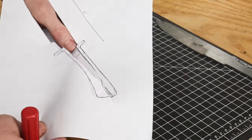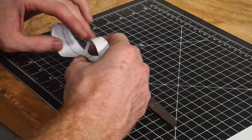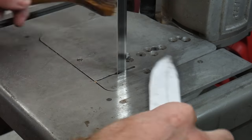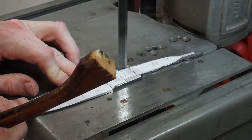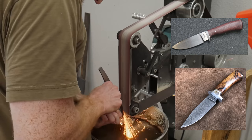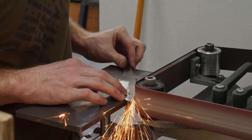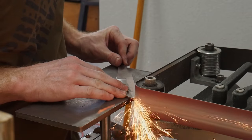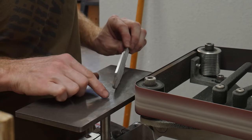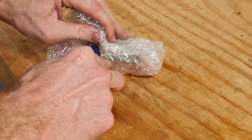I traced out the blade on paper, drew in what I envisioned with the material I had, cut out the template, and glued it onto the knife to easily grind the profile to its final dimensions. It's really interesting how different hidden tang and full tang knife design are — I find it significantly more difficult to get the proportions right on a hidden tang blade. Getting the width and height of the ricasso right, along with the width of the blade, handle, and guard can be a tough process. I'll note that I didn't reduce the height of the ricasso enough and it ended up being a little too tall.